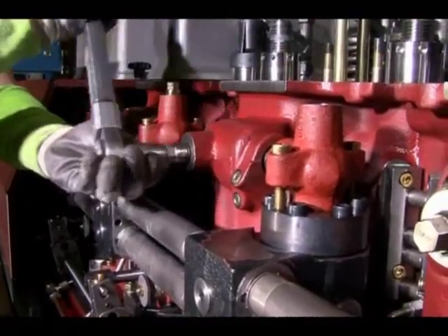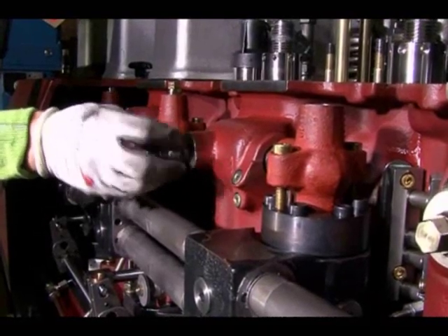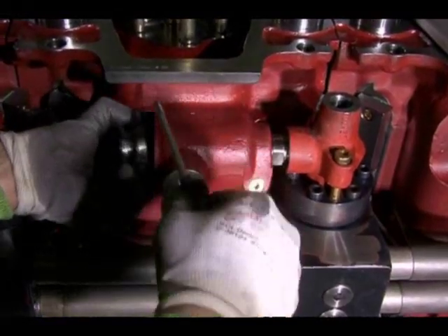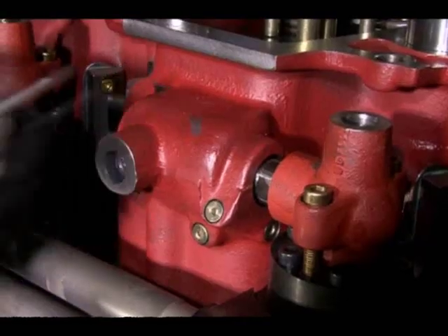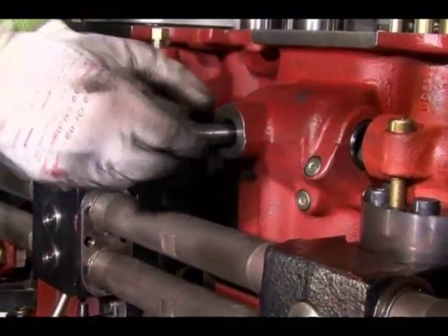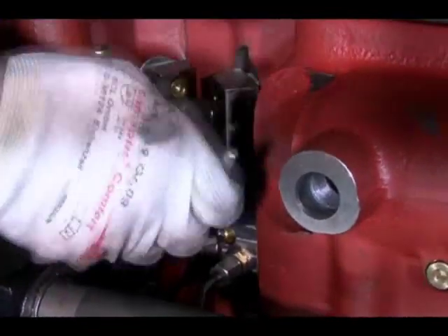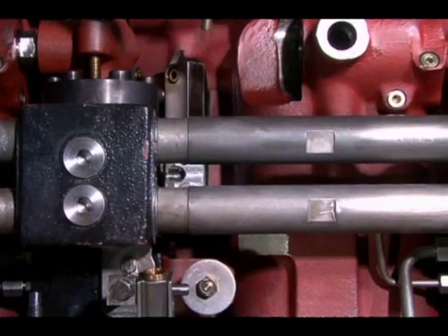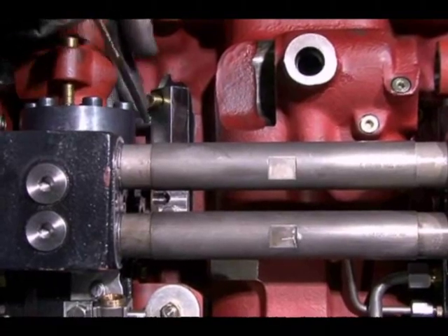On the cylinder head, there is a second thrust screw that also has to be taken out. The transverse thrust piece with cover is loosened by means of a lever and pulled to the left out of the injection pump. The protective sleeve is put back into the cylinder head. Finally, the radial piece is removed from the cylinder head. By means of a hexagon socket screw key, the screws supporting the media ducts on the cylinder head are removed so that the cylinder head is disconnected from the adjacent cylinder heads.